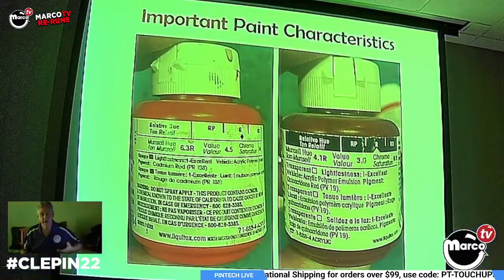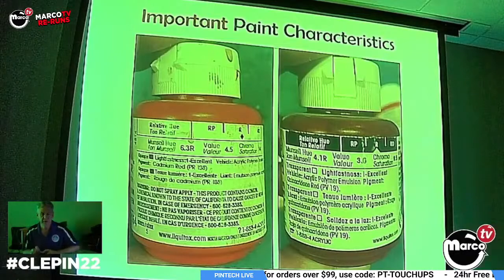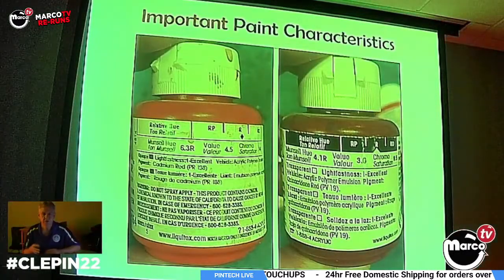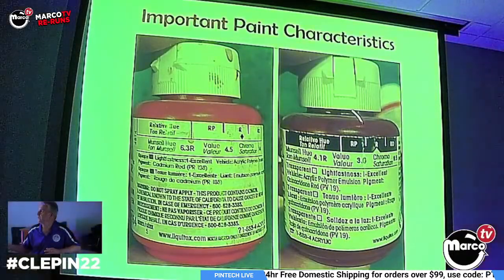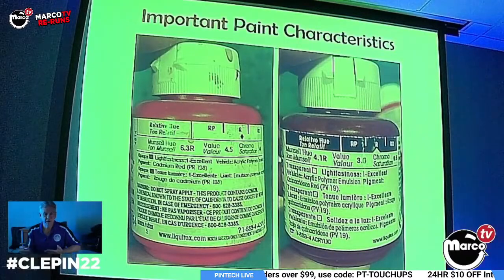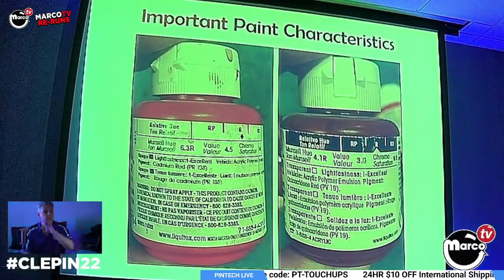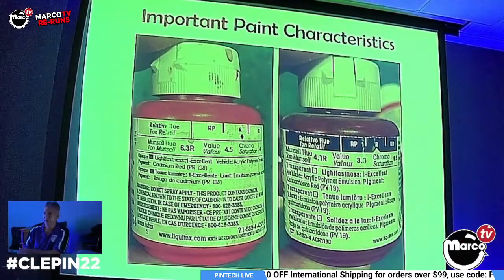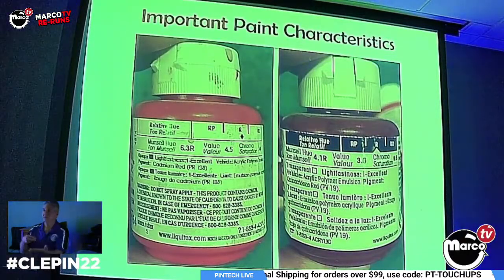So the way we get around that when we paint a play field, for instance, and you've got all these really bright yellows and green yellow colors and these bright scarlet colors, which this color is used a lot in play fields, what we do is we put a white film down first. We put a white layer and we paint over the top of the white layer. So the white is opaque. It covers all the wood grain, it covers anything else up, and it's another screen.